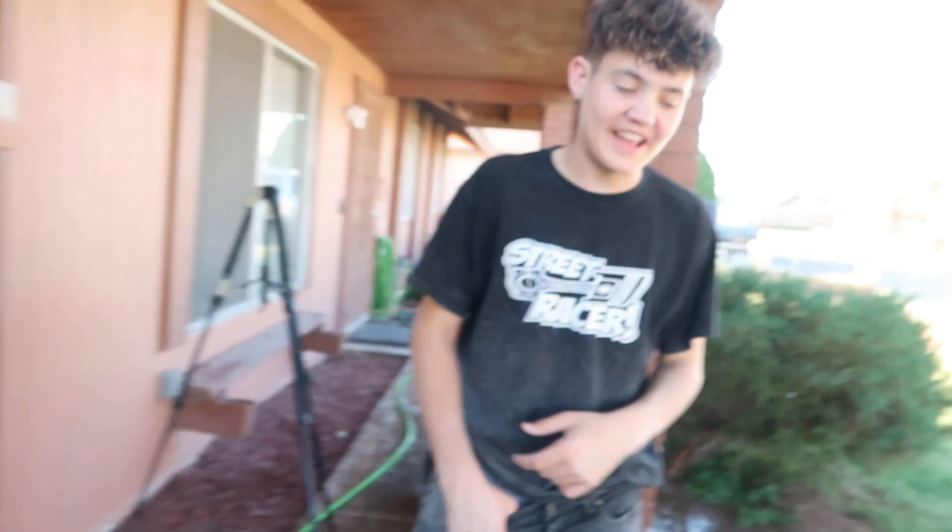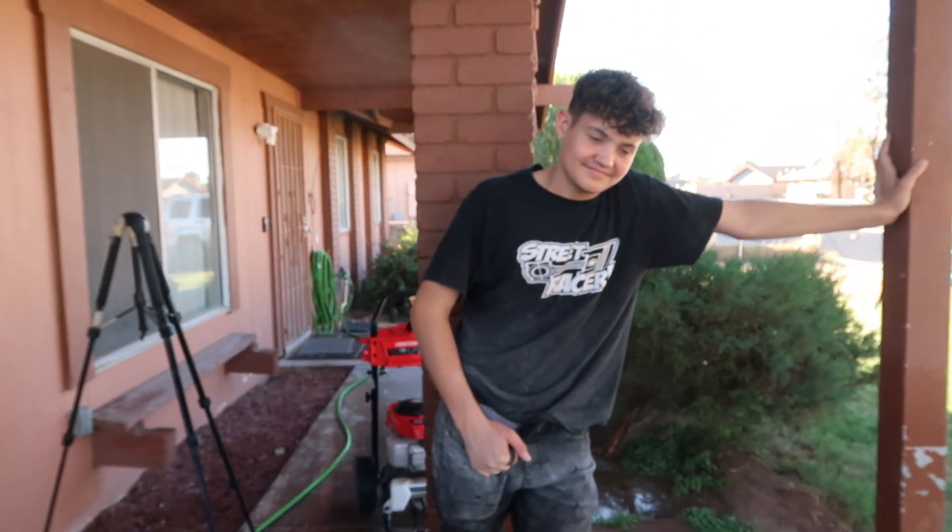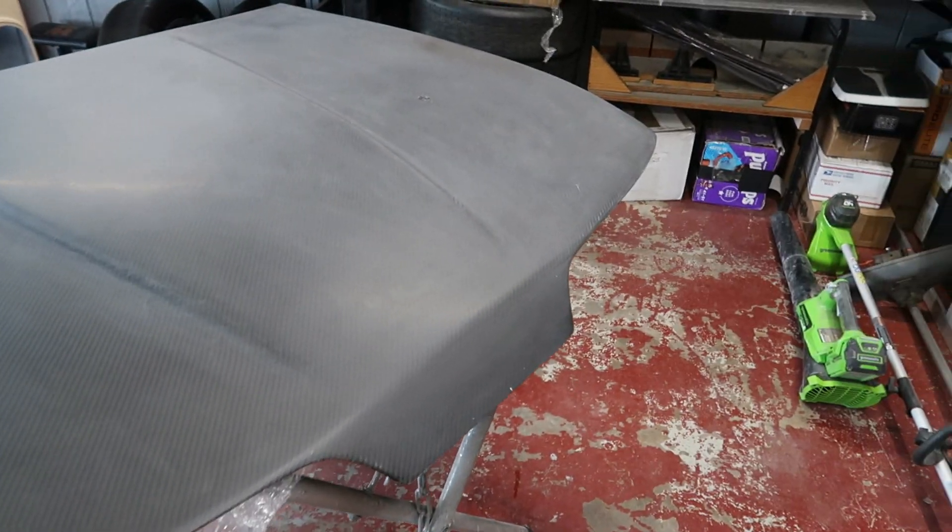The first day I thought I was going to wet sand this thing for 30 minutes and start spraying it. I got this thing all sanded - went through 1,000, 1,200, 1,500, and up to 2,000 grit. I went ahead and got through it because I'm sure you guys are sick of seeing me sand this thing. Now we can officially move on to repairing this hole in the resin, and I think I'll try to repair the other crack as well.